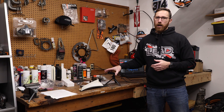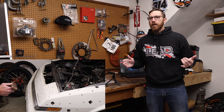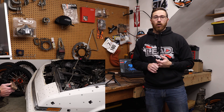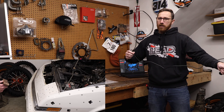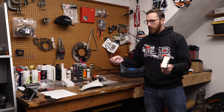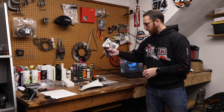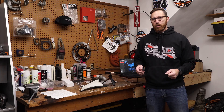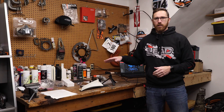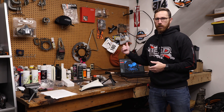I did a test on the front corner of my Starian — with markers on the object and marker tracking in IR structured light mode, you can get it done, but it takes quite a long time. One issue is cable length. The cables are getting longer with each scanner release, probably three to four feet on this one, but there's always a limit to how far you can go with USB-C cables. You're not going to be able to position a laptop and scan across an engine bay or a whole fender. You'll want to use the mobile kit and the RevoMirror app on your phone so you're not constantly looking back at the computer.